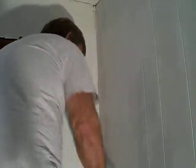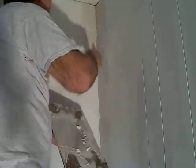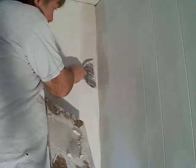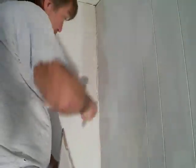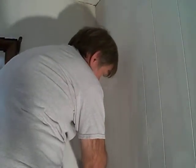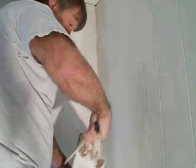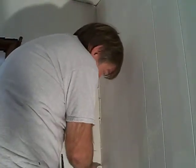That way your paper will stick to this. You'll have it pretty thick, and you do it on both sides. That's why you have your plastic coating down below — it catches the excess. Hopefully I'll have enough mud to do this. Just drag it down. This is the first step — you want lots of mud when you do this.